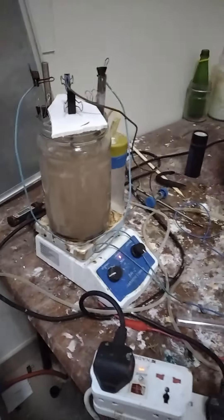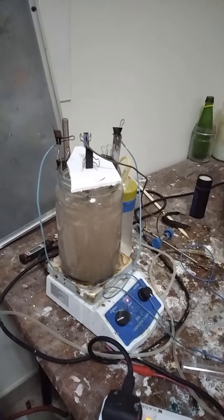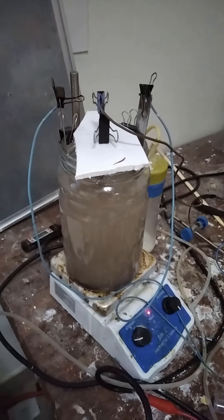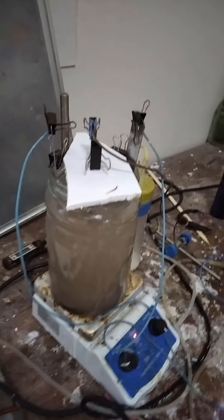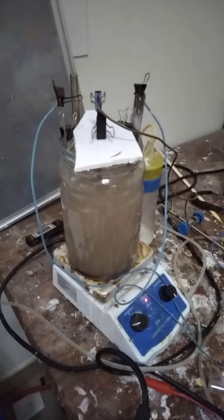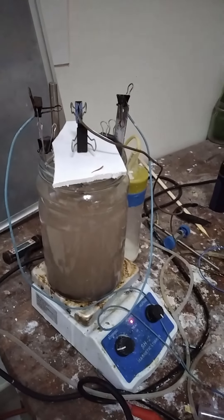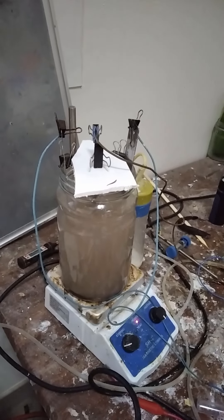I'm just going to keep pushing this to the limit and see how far it goes. This is actually good news that it's eroding like this and not the other way. Overall, this is an expected result. The plating conditions were not ideal, but overall my final verdict on alpha lead dioxide is that it's not as good as a mixed alpha-beta phase, but making a beta lead dioxide bath is annoying. I have lead nitrate and plenty of nitric acid to run this.